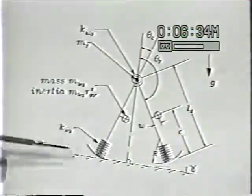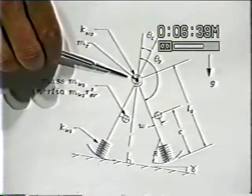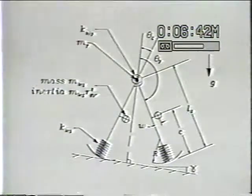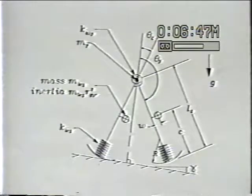The study of passive walking leads naturally to the question: what about passive running? We knew that if a passive running model were to be possible, elastic storage would be important — a point emphasized especially by Neil Alexander, Tom McMahon, and Mark Raibert. So we put some elasticity into the straight-legged walking model: telescoping springs were put into the feet, and a torsional spring was put around the hip. Otherwise we have rigid legs and circular feet, just as in the straight-legged walking model. It turns out this arrangement does indeed have a passive running mode, and we'll end the tape with some animation.